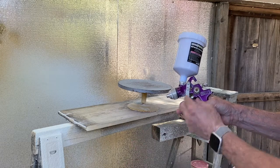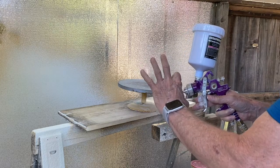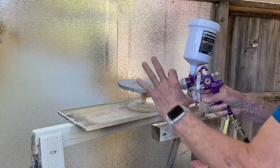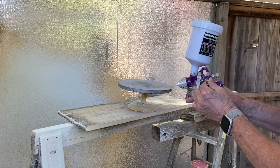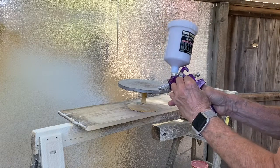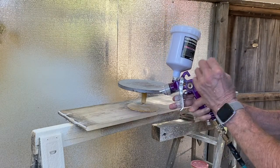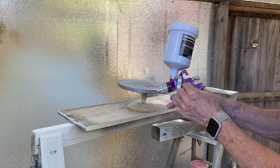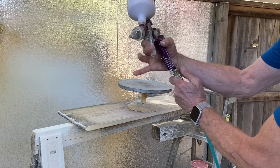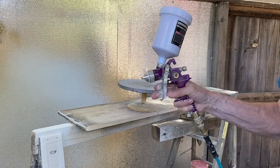I don't know if you've ever used a spray gun, but there's a dial here that adjusts the shape of the spray out of the nozzle. If it's all the way down here, it sprays round. As it goes this way, it gets narrower and taller. So I use it at different places for different effects. And you can see it's leaking. There's where it's leaking. It'll get to the point where it's just pouring out of there and it's time to get another one.